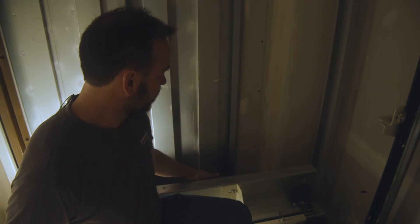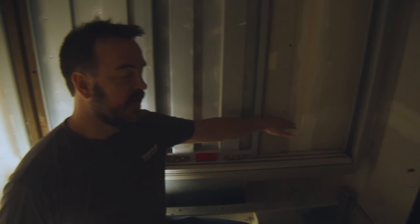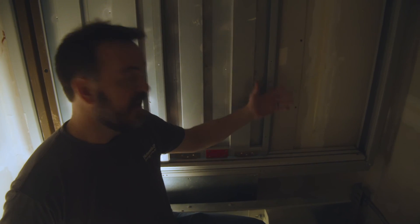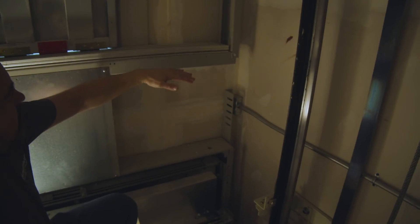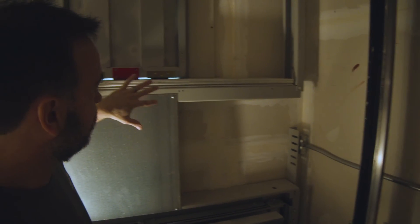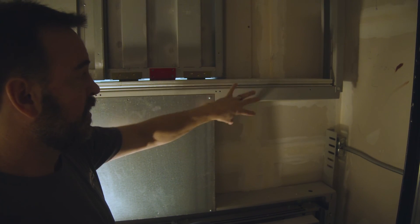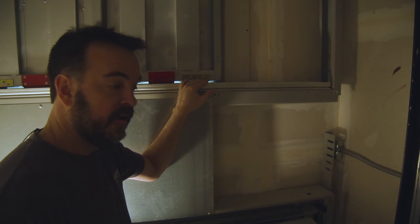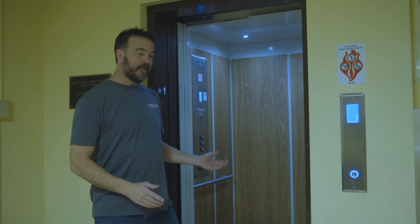Here's the sill of the door — a common misconception is that the door is on the landing, but in fact these two-speed doors are hanging within the hoistway. You can see the hoistway wall is back here; the doors are hung inside the hoistway so they can pocket inside — not into the wall, but within the hoistway itself. Just below this point is where the door attaches, lagged into just below the landing sill. Make sure you have good wood or concrete right below the landing so there's plenty of good space to either lag or anchor into.